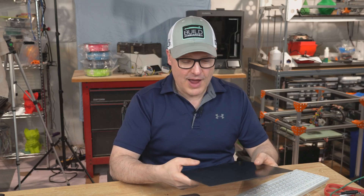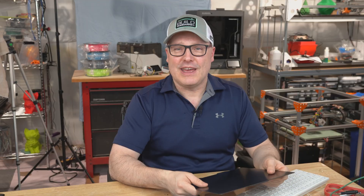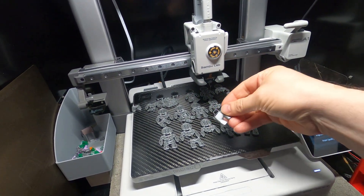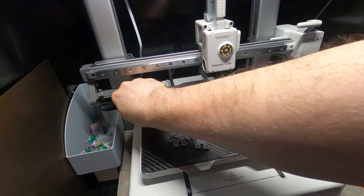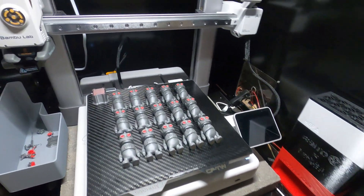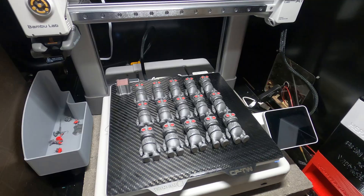Back to the carbon fiber build plate — I have all kinds of cool footage to show. One of the first things I tried was prints without using any adhesion promoter whatsoever, because it was listed as maybe optional. If I did one print at a time, they came out okay. But if I filled the build plate with a bunch of parts, eventually — and I suspect it's the velocity of the bed swinging back and forth — something would come loose and it spelled disaster. So I tried a different model, this time using the glue stick on the bed, and had much better success.